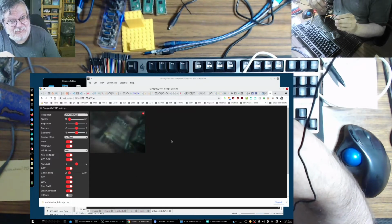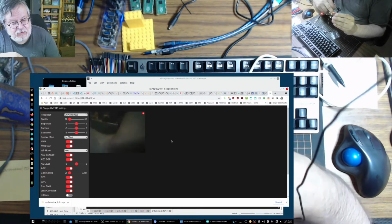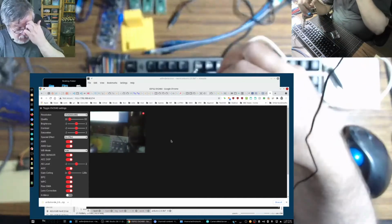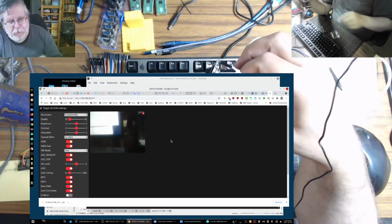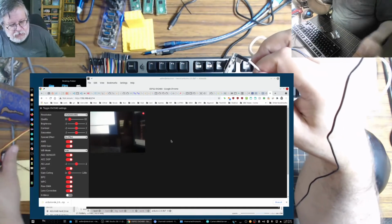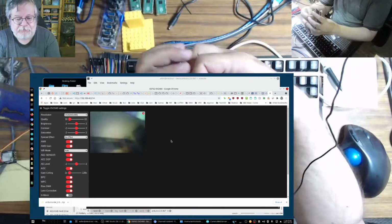So, right there, there's an antenna. And there's a little set of 0 ohm resistor, basically. You have to take it off, and then 2 other pads you have to short together. I mean, a 0 ohm resistor literally is a piece of wire.